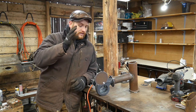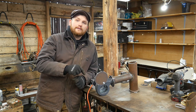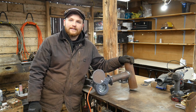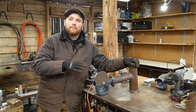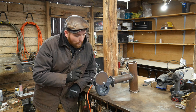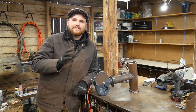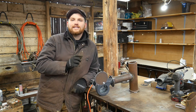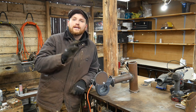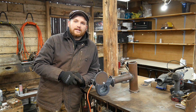So what I've found is that the absolute best blower that you can come up with on the market that's super quiet and works really great in your coal forges, and I just rigged this up as an adaptation to my hand crank forge, so this way I can burn coke in my forge, is a Dayton blower. It's a model number 1TDP3. So what that indicates is that 3 means it is a 75 CFM or cubic foot a minute airflow blower, and they are very, very super quiet, and with just a little bit of adapting you can plumb them right into your forge build.